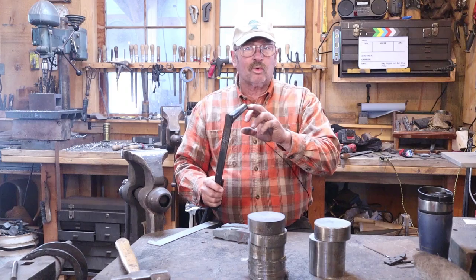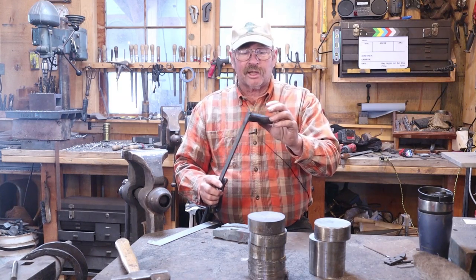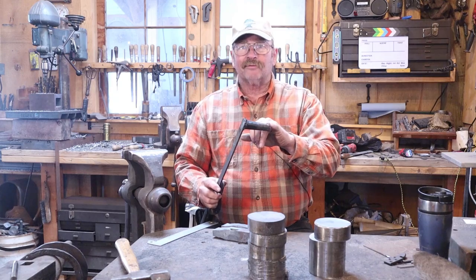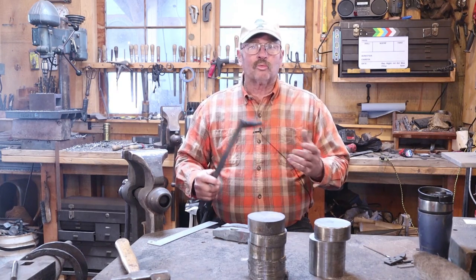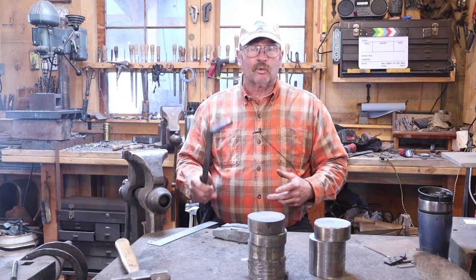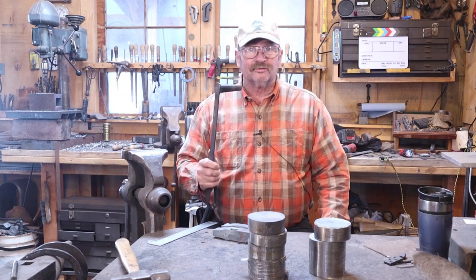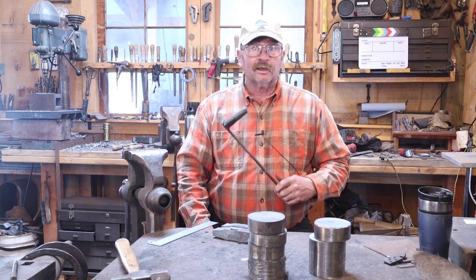And it's about 3/4 inch diameter on the working end, tapers slightly up the shaft, and this is about 3.5 inches long. If anything, it's a little bit too long because the working height on the Say-Mak isn't real tall, but it is tall enough to get a 4-pound hammer and this punch under it and still get enough work done. It'll take a few heats to punch the hole, but it does do it.